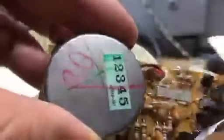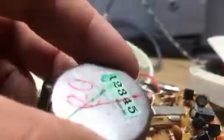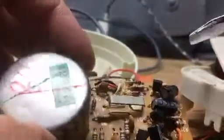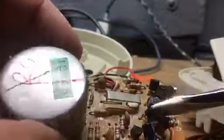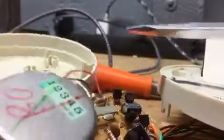And then this same ASIC then just has all of these capacitors and resistors out here as matching networks, isolation, etc. And then you see these little Qs here, those are little transistors. And those transistors exist to then switch current off and on to the flash bulb circuit, which is going to be using several of these caps, and also to the warbling siren that you get from the piezo buzzer here.